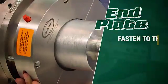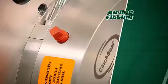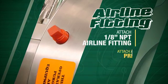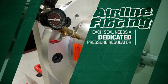Place end plate against housing and fasten it to the bulkhead. Tighten all external bolts to manufacturer recommended torques. Finally, attach a 1/8 inch NPT airline fitting into housing and attach airline with pressure regulator to tubing port. Each seal needs to have its own dedicated pressure regulator.